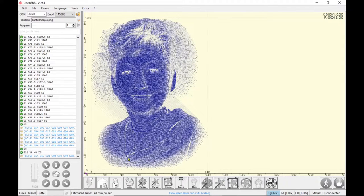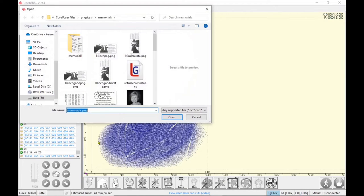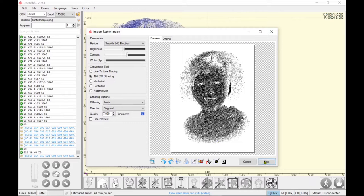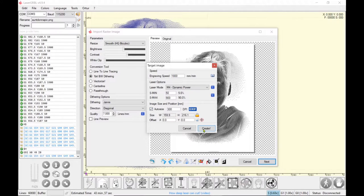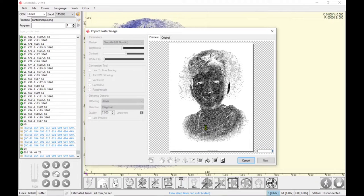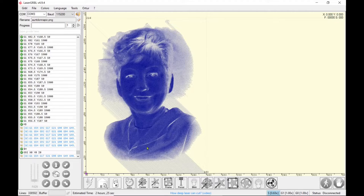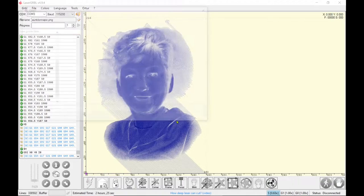It's popped up and my engraving estimated time is 43 minutes and 57 seconds. I wanted to open the file one more time to show you what happens if you used the regular setting for a 300 DPI photo with seven lines. Slate is a whole different animal to try to engrave — you definitely cannot use line-to-line tracing with grayscale. It only burns white and you can't burn any whiter. We've really lost our dots per inch; it's just smoothed over, which would be fine for grayscale engraving but on slate all you'd get is one big white blob.